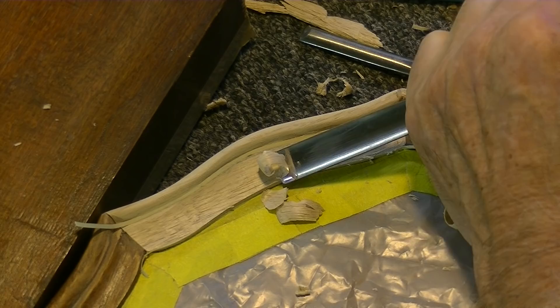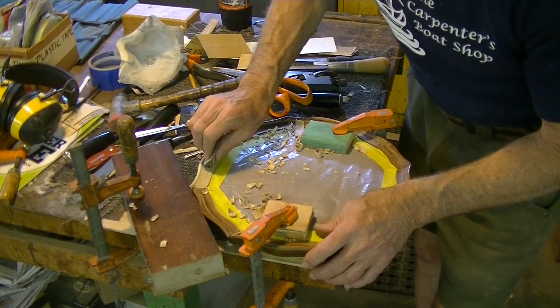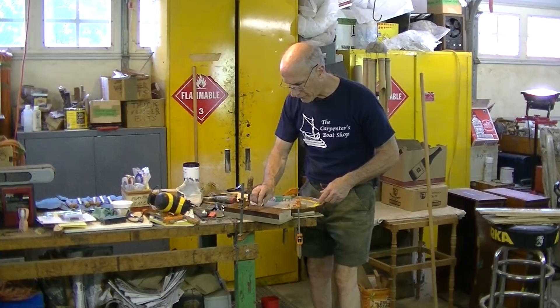I think I'm ready to start sanding. I'll start with a little bit of 60 grit, and I have a full contour sanding pad that will help me maintain that cove. I guess I can pull off my tape now. I think I've got this sanded pretty well, at least for the 100 grit. I'll sand it a little more later, but now I'm going to sand all the rest of the moldings all the way around, down to the bare wood to get it ready for finishing.